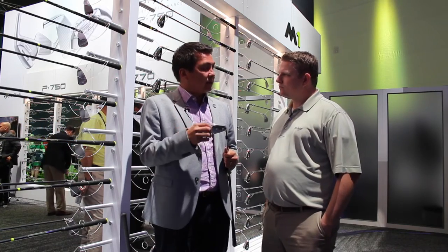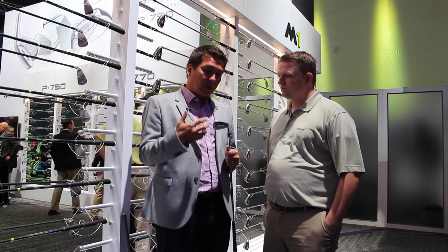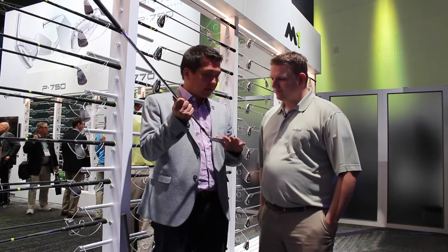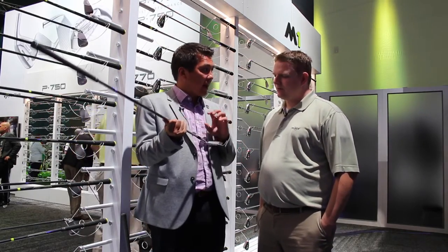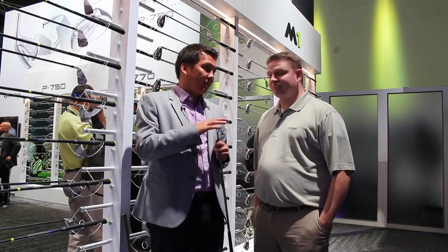We're going to see a lot of good players on tour playing this, single-digit golfers, but even some aspirational 10 or 12 handicappers are going to find it surprisingly playable and love the look and feel of it. We're also incorporating really high-tech precision features. We mill the faces on these products just like a putter — you can see the milling marks here. They're dual-milled: we mill for flatness, then put this texture on so people know it's 100% accurate every time. The grooves are going to be perfectly to spec — a very high-precision instrument for the better player.